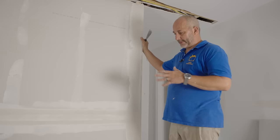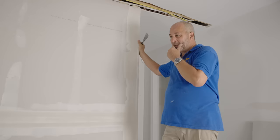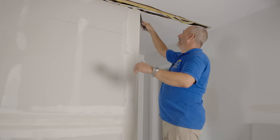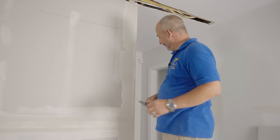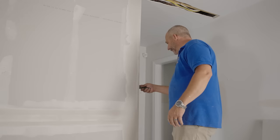Here's the point. Drywall and drywall compound are designed to absorb moisture and then release it again. So even during your construction phase, if it's still holding too much moisture, it's not a negative. It just means that you've got to use a really decent quality drywall sealer when you go to prime your walls. Don't buy the cheap one that costs you $10 a gallon. It won't work in this kind of environment. But if you buy something like, I hate to say it, the Home Depot Behr primer, it's actually pretty decent for drywall. That'll work, in my experience. I'm not talking on behalf of Behr. They might have a different opinion, but in my experience, that works.